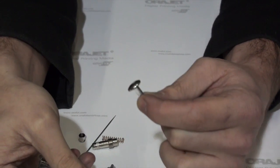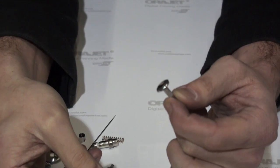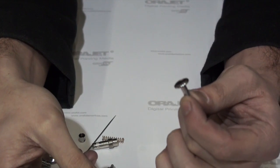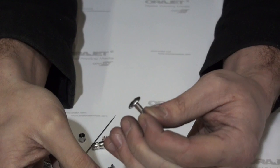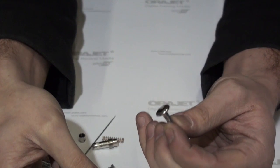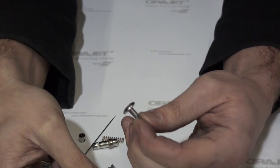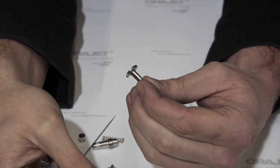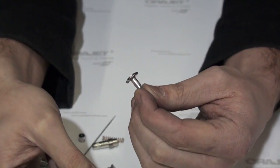On the end of it there, you can see another piece that pushes against the trigger. The trigger is the piece that you push down and pull back to get the paint. So the needle passes right through here. Once you've got the needle out, it's possible for this piece to fall out. Keep that in mind when you're doing this — you don't want it to break, you don't want to lose it. If you're in a warehouse like I am, it can be very easy to lose little things like this.